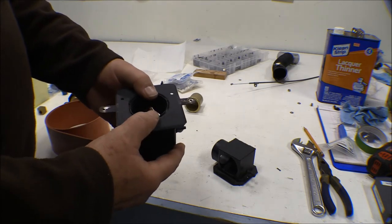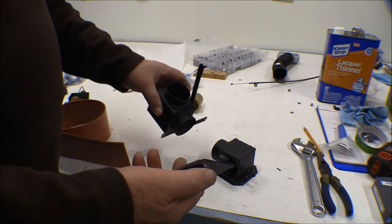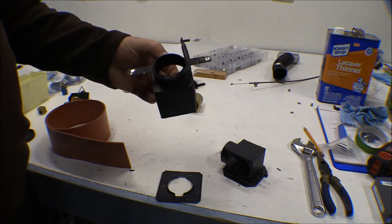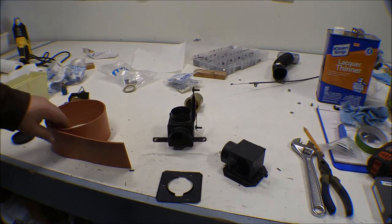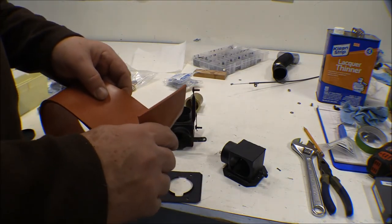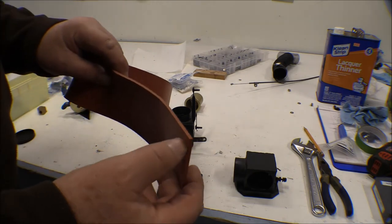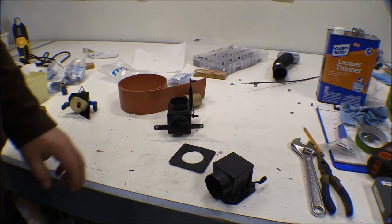I'm going to change that a little bit — I think I'm going to rivet those ears right to this little plate and put nut plates on this plate. I'm going to sandblast this down. I cleaned it up and painted it with high-temp powder coat — it just doesn't look too bad and it probably doesn't need it. I'll have to think about it and see whether I'm going to do that or not. I got this silicone baffling material I bought years ago — it was the wrong stuff, not what I wanted — but I was going to make a gasket to go between the firewall and the heat box to kind of seal that up. I think this material is a little thicker than I want so I'm going to go see about getting something thinner to seal those up and help keep the air going in through the heat box and not heat up the firewall right there.